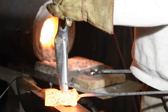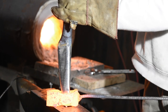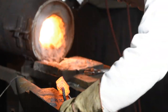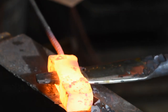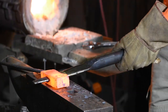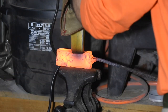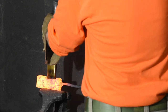I start out using the hardy hole on the anvil. In subsequent heats, as the tool gets too big for the hardy hole, I'll turn to my post leg vice. As you can see, the drift causes a pinch in the head, which we'll need to remedy. I'll do that through a combination of work with the press and the hammer.